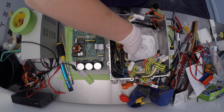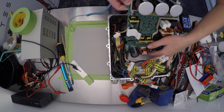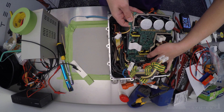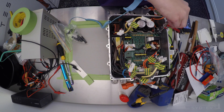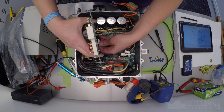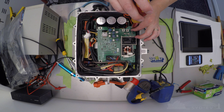It's time for reassembly. Don't forget to replace the heat transfer paste under the board before putting it back in. The reassembly is just the reverse of pulling it apart — just make sure you remember where everything went; that's where the drawings come in handy. Also don't forget the eddy current suppression ring bolted to the side, and some fresh sealant when putting the top back on.